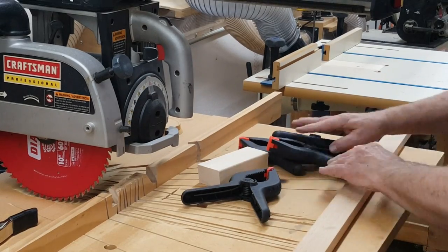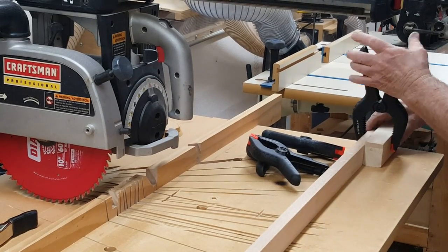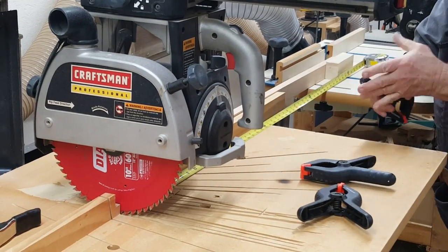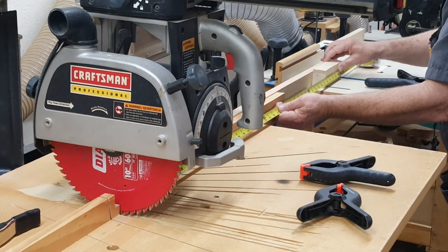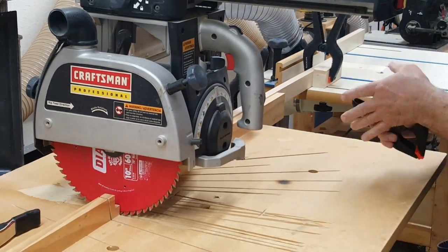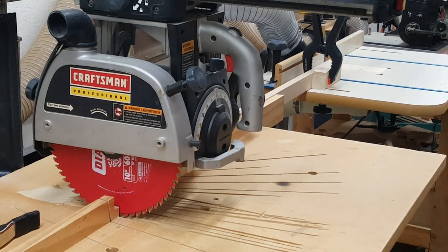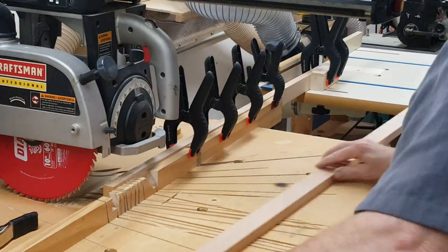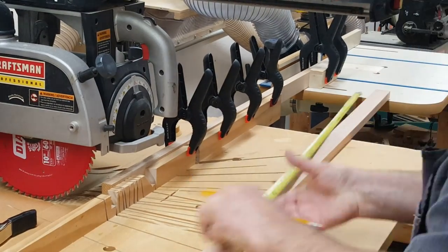The 7 vertical rails are all cut 41 and 3 quarter inches long, which is way off the table. I wanted to measure once and use a stop, so I made a temporary extension for the fence from a 1 by 3 and a stop from a scrap of 2 by 4. The stop needed to be 2 by 4 because a piece of 1 by would have only come even with the table's fence and not stuck out past it.